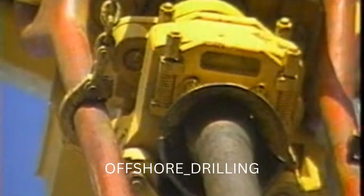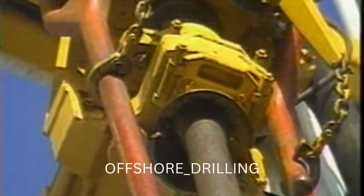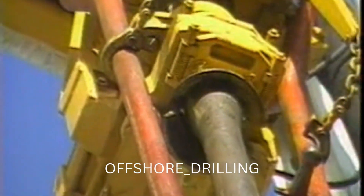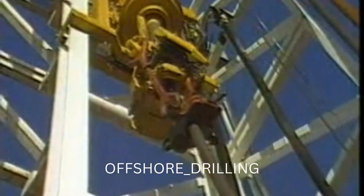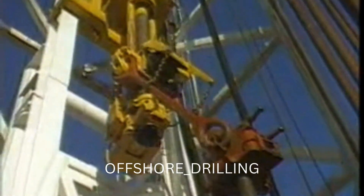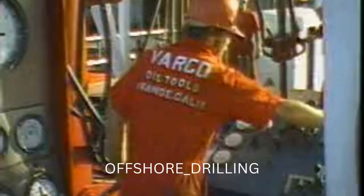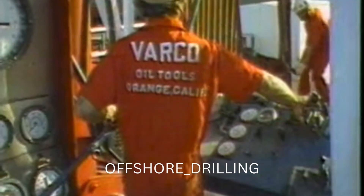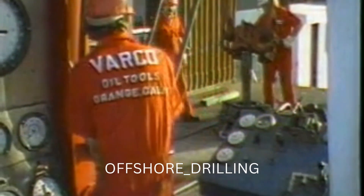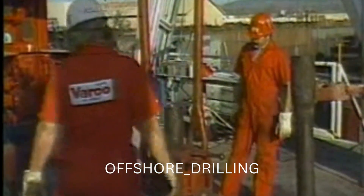A hydraulic torque wrench is mounted beneath the drilling motor to break out connections at any point in the derrick. This tool is an adaptation of Varco's proven successful TW 60 torque wrench, hundreds of which are in use all over the world. The top drive drilling system is mounted in a dolly running on rails in the derrick structure. These rails may be incorporated into most existing derricks or masts with little or no additional reinforcement of the structure. The controls are built into the driller's panel and are designed to be familiar to the driller. An ammeter and a tachometer are the only additional instruments, while the controls are usually integrated into the existing electrical distribution system.